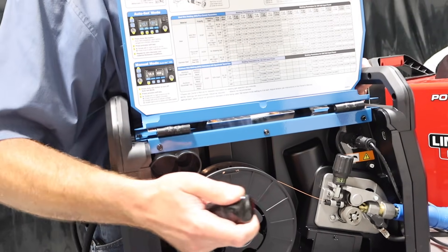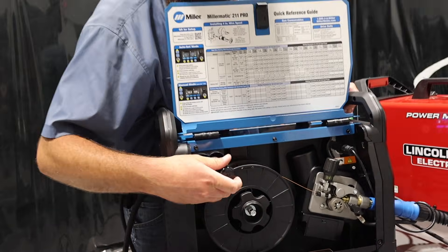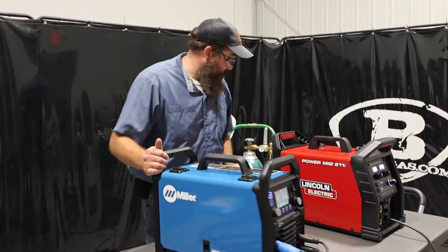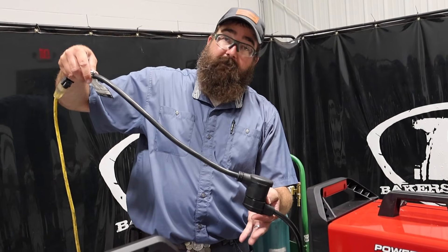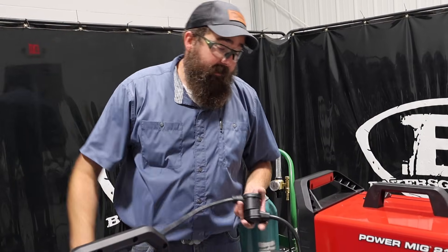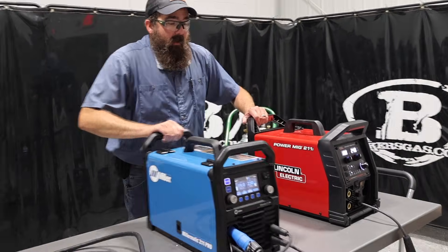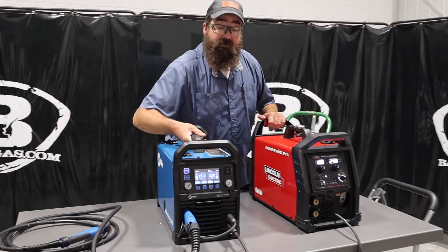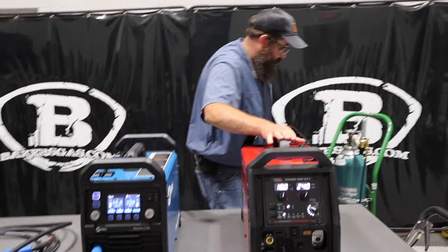This is unique to Miller though — you just unthread a plug. I've got it plugged in at 220, and then that one plugs in and you go to 110 using the same cord. Whereas Lincoln here comes with an adapter — that molded 220 plug into a 110 adapter. It comes with a molded 220 plug on it. The Lincoln is noticeably heavier; this one's 35 pounds, and the Lincoln is noticeably heavier than that.